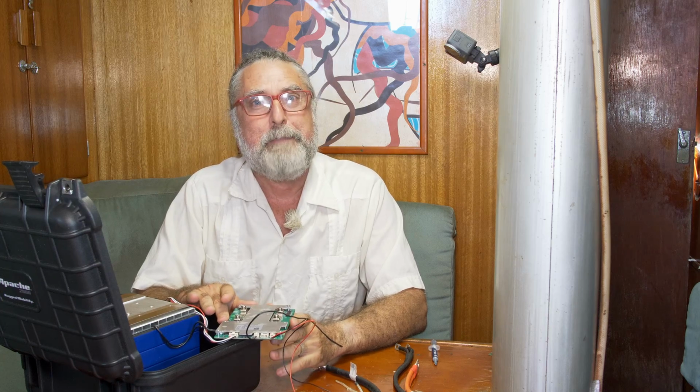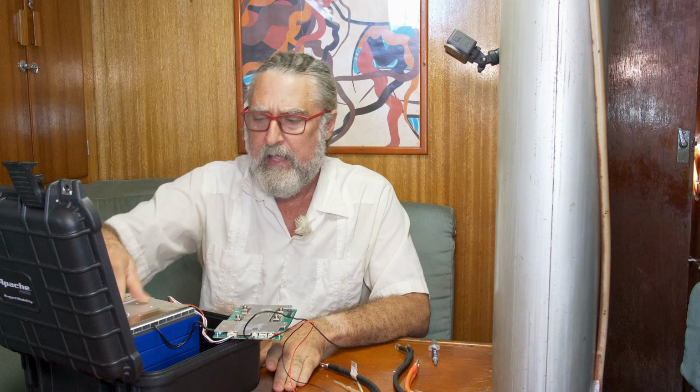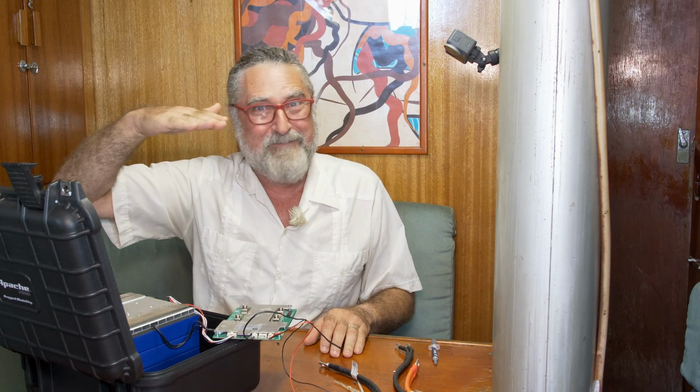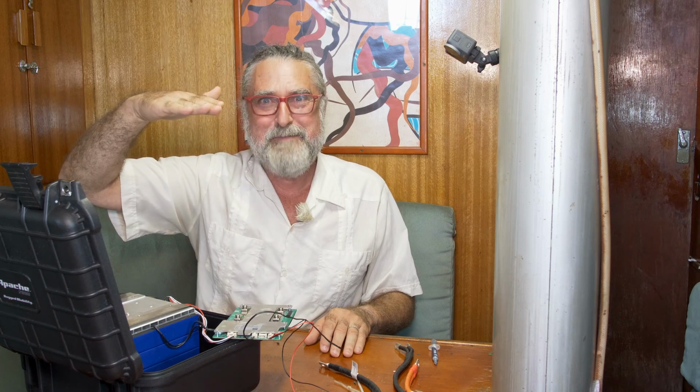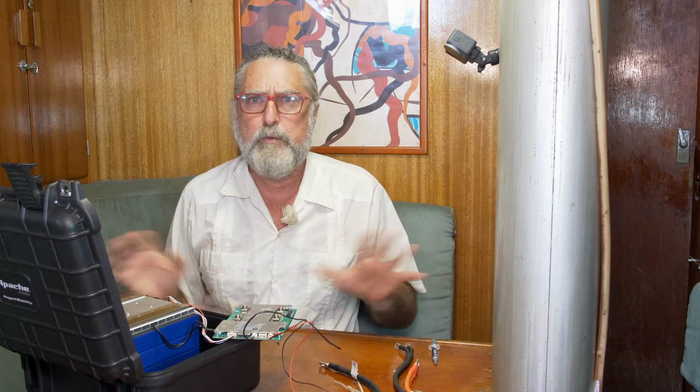The BMS's probably biggest, most common job is watching the charging of this thing. If you charge the voltages up so that any cell is above a certain limit, this will shut down charging. If you go a little beyond, very little actually, that limit, the cell will outgas, it will pop its vents, and it will die in very short order, just plain drying out inside. Also, the room will smell horrible and it's probably toxic.